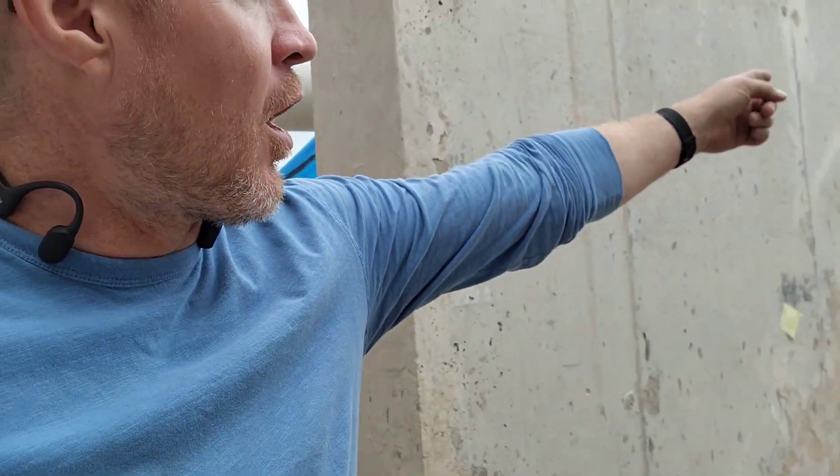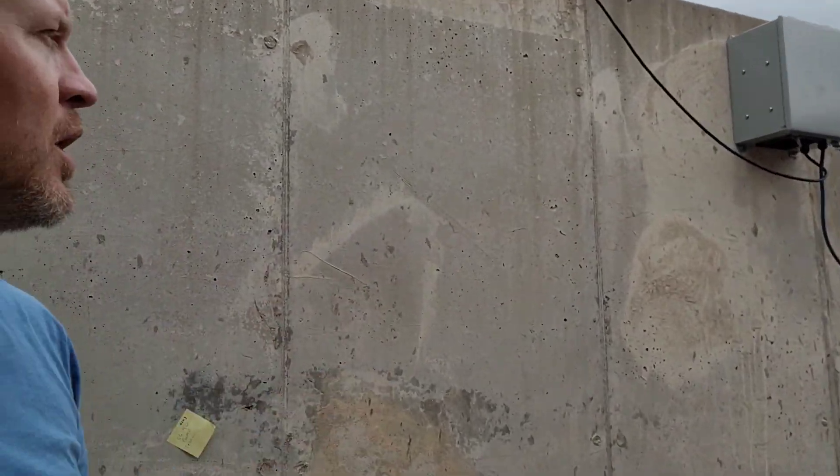We can run our Clear Comfort AOP system up here on the wall with no problem. I love this device. I'm super excited about it finally being on the market. For those of you who've been in the industry as long as I have, you know what I'm talking about — nuisance tripping on safety switches. Don't bypass them. Get an AUI, add some PLC logic to your safety problem, and when there's an issue, you'll be able to troubleshoot it much easier, much faster. I just installed it with a guy who had never seen it — it took us 25 minutes. First time he'd ever put one in.